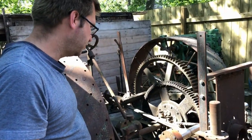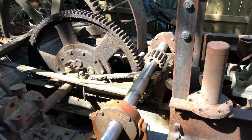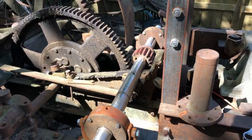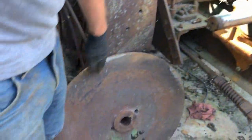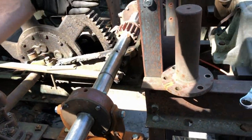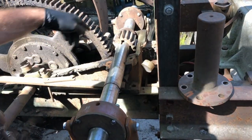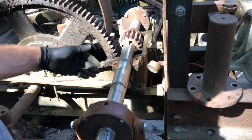Okay, just to show here, I threw her together here is just how the kind of the friction drive and the sliding shaft works. It's a little bit goofy. There's one of the friction discs there, so that would sit right here. So it would obviously sit this way. Your flywheel sits this way. As it turns here, the flywheel turns the friction disc turns your shaft.